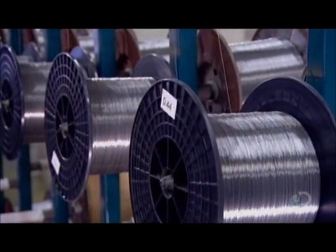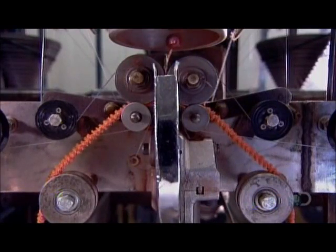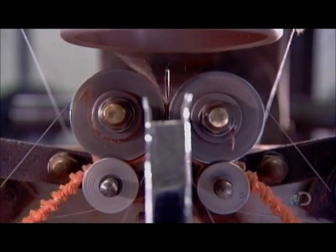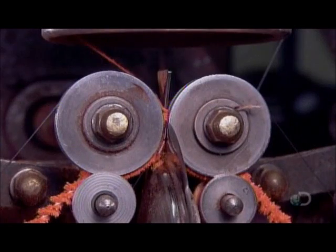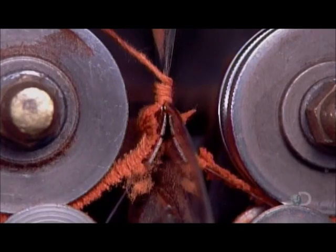The pile of yarn rapidly winds around a metal former to coil it. At this point, the diameter of the pipe cleaner is set by using metal formers of different sizes. A sharp rotating blade cuts the coils to produce a series of short tufts. They stop the process briefly to give us a look inside.